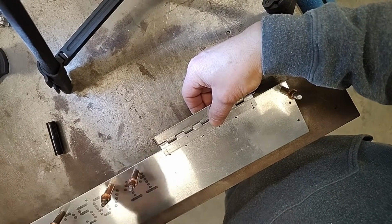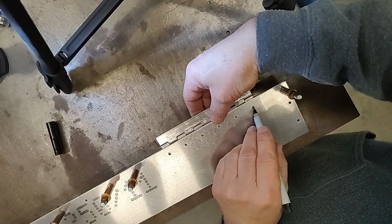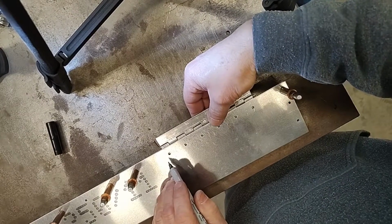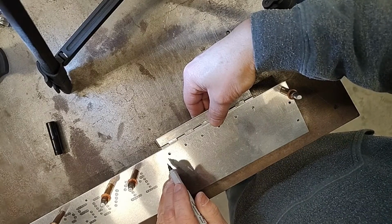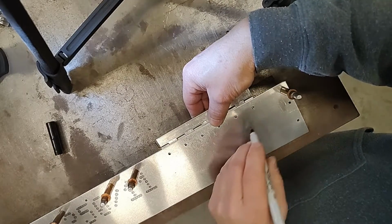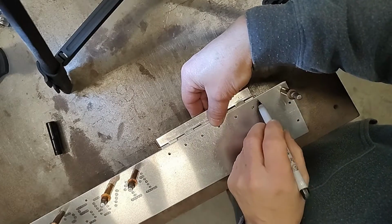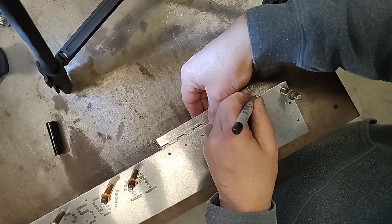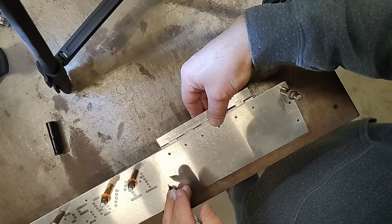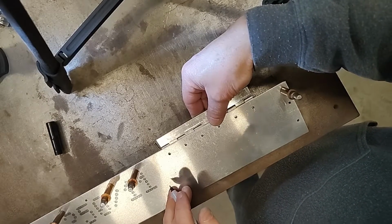That way when I have it underneath, it's easy to see those holes and see the line that I just drew. So now we are looking for locating our first hole. We know that from a vertical view from this surface of the trim tab, we want to see half of the thickness of that pin. So this is where we can play with this dimension.